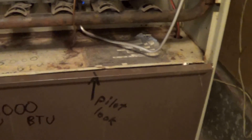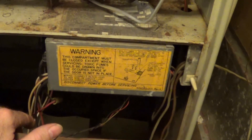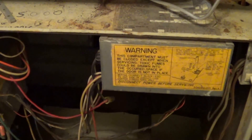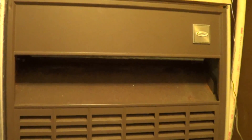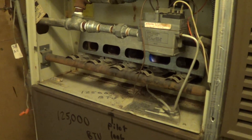The way this works: there's a circuit board down inside here, hidden in this box. What it does is run the fan for another minute and a half just to draw the heat out of the unit — not to waste it. Kind of a rat's nest of wires, but it works. I've got one of the covers on the right side — Carrier. I've got to put the one still on the left. Normally they're always on; I just took them off to shoot this video. There's the pilot light going.